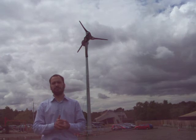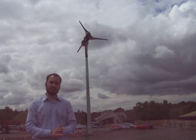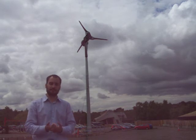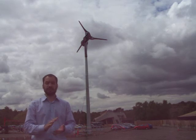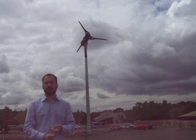This wind turbine is large for a domestic situation. The largest I would normally expect in a domestic situation might be a 6kW wind turbine, so this is over twice the rated power of that. It's more normal for people in a domestic situation to have a 2.5kW or a 1kW wind turbine. It's very hard to predict energy generation because it depends on individual circumstances and how much wind there is, but I'd expect a 6kW turbine to generate at least 5,000 units of electricity a year in a sensible location, a 2.5kW turbine about 2,000 units, and a 1kW turbine about 800 units.